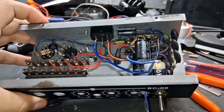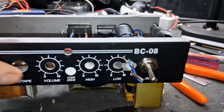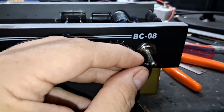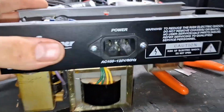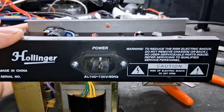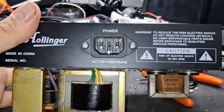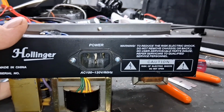So the power supply section's all redone now. I got a toggle switch on the front and some wires sticking out for an indicator light. Maybe we'll just leave it like that forever. And on the back where the stupid power switch used to be, now I got an IEC connector, and it looks like it was supposed to be there. Man, you can't argue with that.